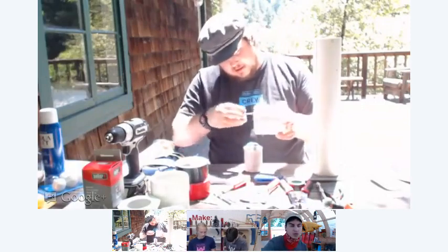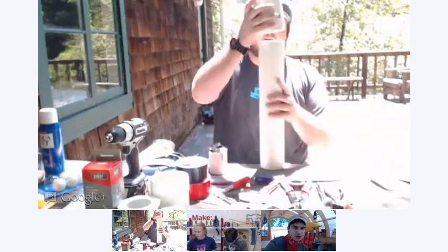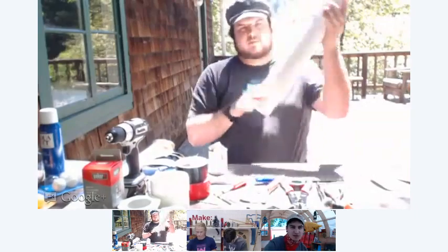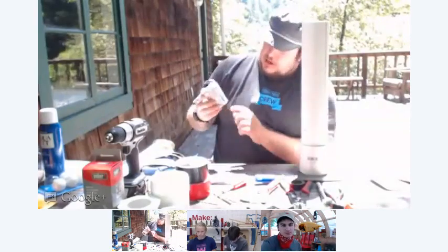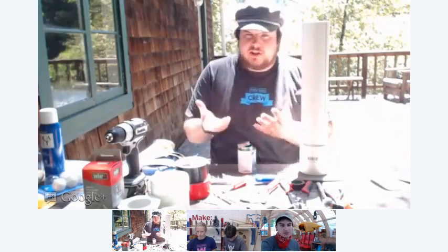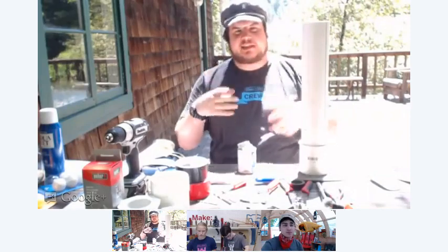So what are all the different glues, Dan? I know there's like purple glues and green glues and gray glues, and there's PVC cement and there's cleaner, and how does that all work, and what do we need for this project? Right, so you just need to get the blue stuff. It's just wet and dry PVC pipe cement. Okay. It's a solvent. It actually melts the plastic, and then when you put the two together, it hardens and actually physically bonds them together, so it all becomes one piece of plastic.